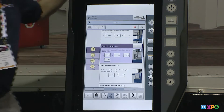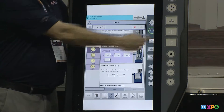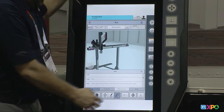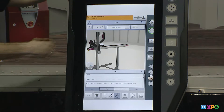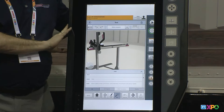Once those positions are changed, the robot is actually ready to pick a part. I can reference or home the robot with our one-touch reference. The robot would be moving to the home position. Once it gets to the home position, the screen tells you it's in home position and it's ready to take off. I could right now put it in automatic and start picking parts.